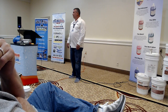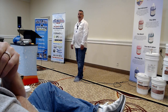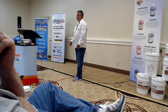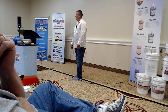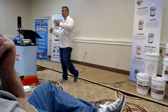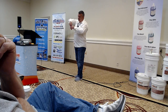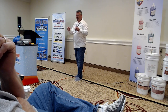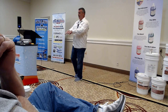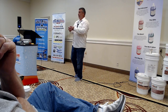Yeah, just dry. If you wrap it like in heating, like one of those foot heating blankets, and just plug it in. It's not that necessary. You got three-way valves and things of that nature, the accessories that are on it and everything, but just get it dry, just get the stuff out of it. I left mine out, and in Tallahassee we had a whole week of 20s. It's rare. I just loosened the hose clamps on mine, and then I loosened the three-way up a little bit, and there was some residual in it. When I came out in the morning, my deck was pink right there because it had pushed it out. But if you don't give it somewhere to go when it expands, that's it.